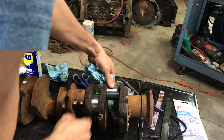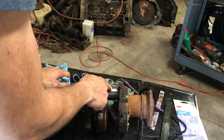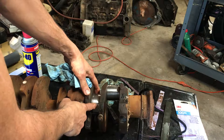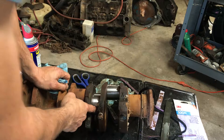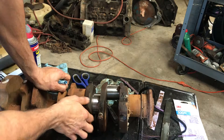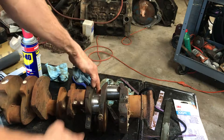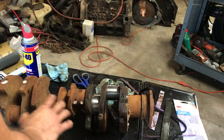I measured it and it's at the very bottom limit — it's like 2.124. It's supposed to be 2.124 to 2.125, and these are exactly 2.124 when done. This one right here I think measures around 3.805 — I can't remember exactly. But this one was the same, right at the very bottom. You've got like a thousandths leeway, but they're perfectly straight — no taper — measuring exactly the same all the way around.